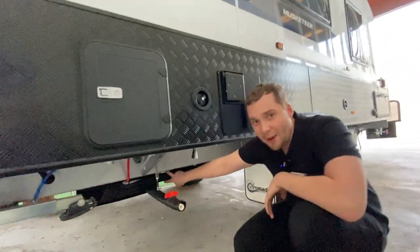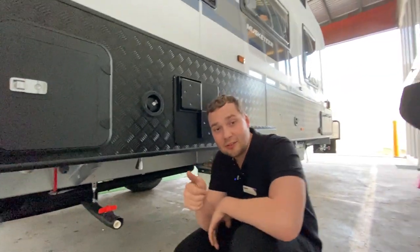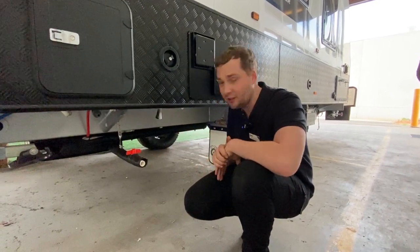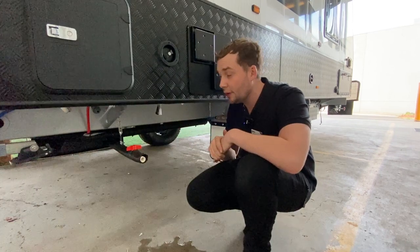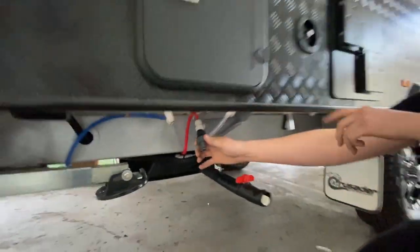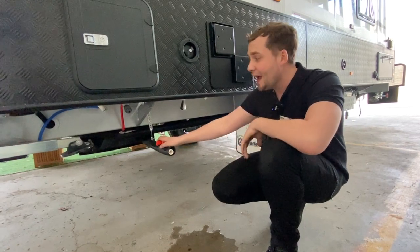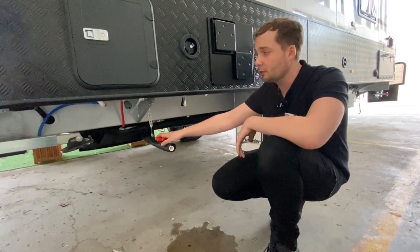All PVC piping has underpipe protection with plastic coating throughout, and we use John Guest fittings recessed quite high onto the caravan itself to make sure high branches and obstacles on the road don't cause issues — no broken water tanks. They're also checker plate water tank protected underneath. We have the grey water outlet — open and close it depending on the situation, especially in national parks. The grey water tanks are fitted with smell traps and a cleaning system — plug your hose to the system, push water in with some Domestos, and it flushes the tank clean. Crusader's director is a plumber by trade and these are the improvements he's implemented so you won't get those bad smells that everyone complains about.